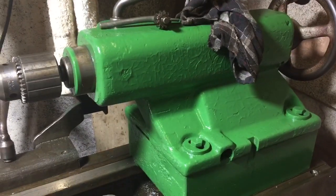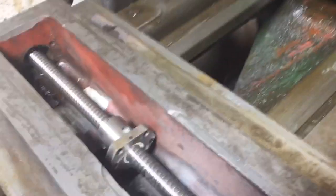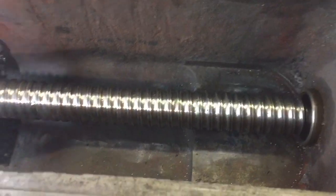This tailstock got a good paint job — well, it's a bit crinkly — but I'm back onto this bit here, so the old end of the lead screw is fastened to the new one with an M8 screw.